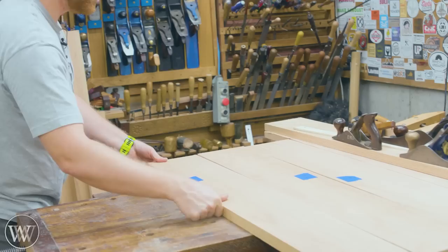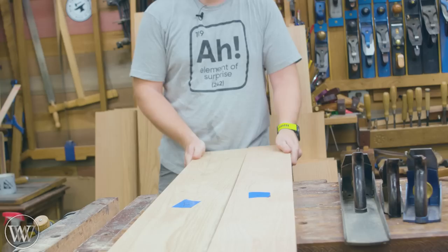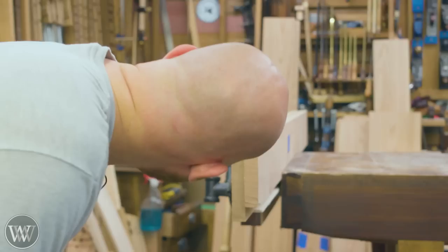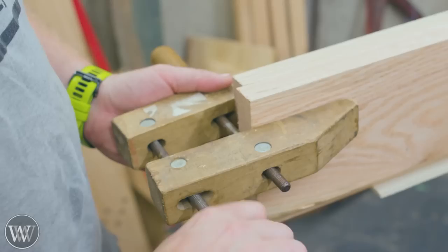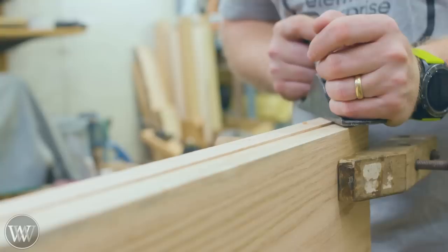The stretchers are really easy - those are just boards, so they don't need much other than cutting to length. But for the tabletop, that's a lot of boards we need to laminate together. I could do the tabletop in two glue-ups, but then I might have problems joining the two panels together. For this size, I'm just going to do it all as one big lamination. I'm going to clamp up two boards so that the top side of the table faces out on both, and the down side is in toward the other board.